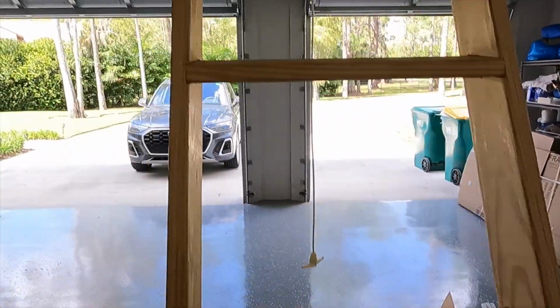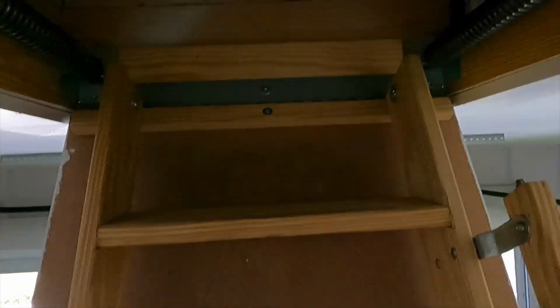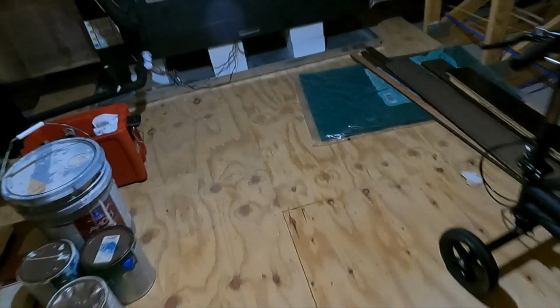All right, so we're gonna go ahead and head up to the main house air handler here in the attic. I have the drain line being vacuumed currently. So we're gonna go ahead and flush that while it's running. You can hear it pulling there. We like to flush the drain line with hot water while we're vacuuming. That gives us our best chance at a decent clean during a maintenance.